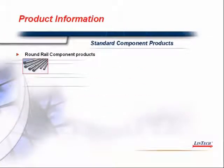In 2007, Lintech greatly expanded its component product offering to include custom machined hardened shafting in 1/4 inch to 2 inch diameters and 8 millimeters to 50 millimeters metric diameters. Common processing is cut to length, tight length tolerance, coaxial and radial holes, flats, keyways, notches, dowel or butt joints, reduced diameters, and threaded ends. These shafts can then be used in conjunction with several support types.